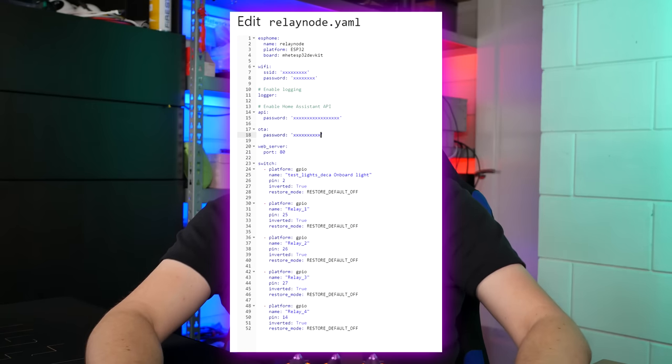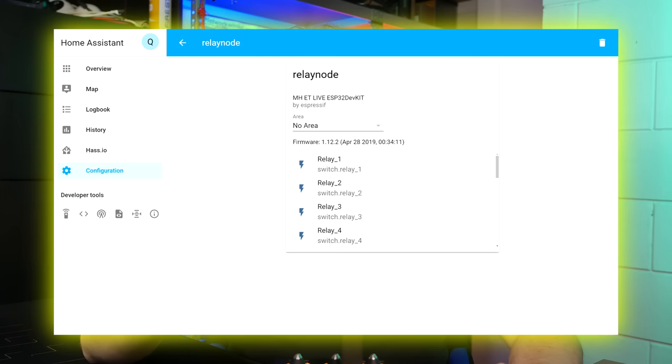Let's take a quick look at how this works. I won't be going into the ESPHome code in depth — I'll put it on the screen right now — but as you can see, the ESPHome code is really easy, and after that you can just use them in Home Assistant. If you want to know how to create, compile, and upload this code, you can check out my previous temperature sensor or power meter videos. I will have the code linked in the description to a blog post. Once the modules are running the configured ESPHome firmware, the relays are available from within ESPHome's web interface or Home Assistant and can easily be switched. That also means they can be used within automations or things like Node-RED — but that's the subject for a future video.